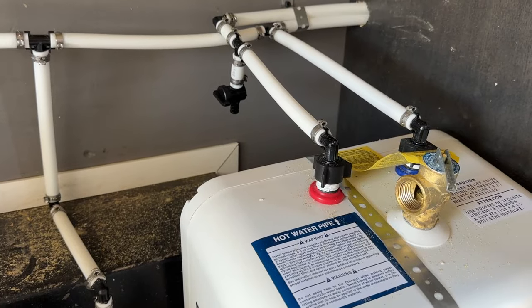PEX piping — I used half inch. For that you'll also need a crimper, a pipe cutter, elbows, tees, crimps, ball valves, and half inch female fittings. As a pro tip, we're going to need a bunch of these — your faucet, your water heater, and your bartender rinsers all use half inch female pipe threads (half inch FPT). You'll also need aluminum hanging strap, Teflon tape, PVC glue and primer, a hole saw kit, drill, jigsaw, straight edge, level, silicone, plumber's putty, and a 3/8 compression to 3/8 BSP fitting if you need the BSP fitting for your espresso machine.